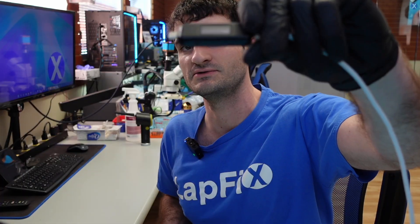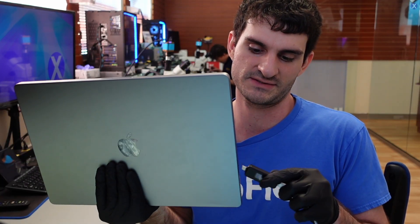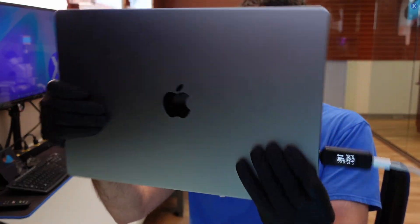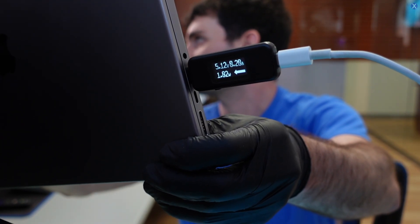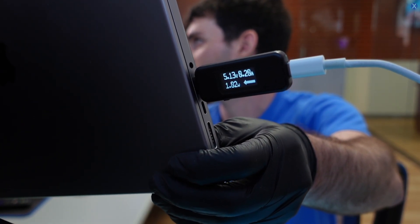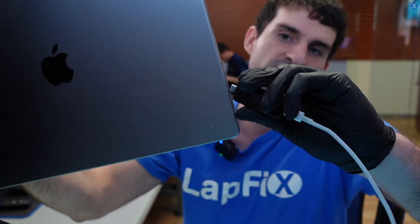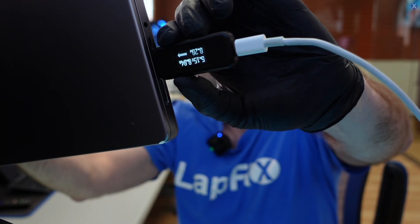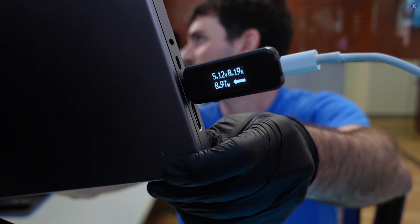We can first test with this — this is a USB-C tester, and what it's going to do is check how the MacBook is taking in voltage from an outlet. It's going to tell us a lot of stuff we need to know before working on it, and it's pretty obvious to tell if there's a board problem just by plugging this in. We see 5 volts, and the current's very low — about 0.20, which is very low. Let's see if we switch ports, because sometimes it can tell us something different. And it's about the same.